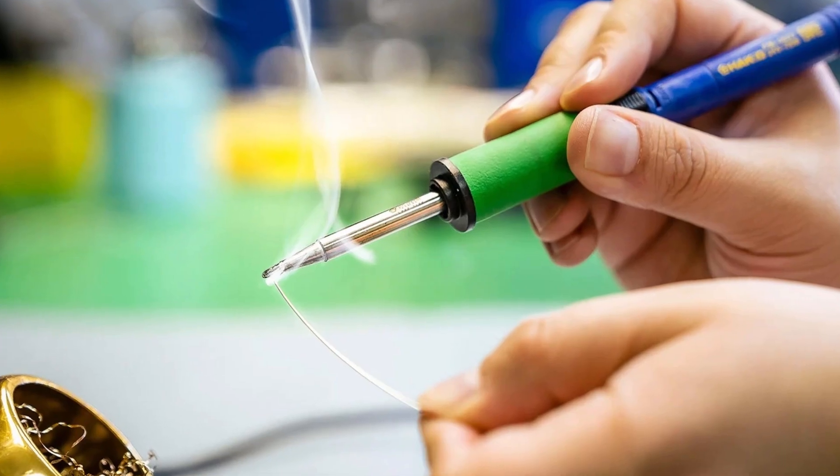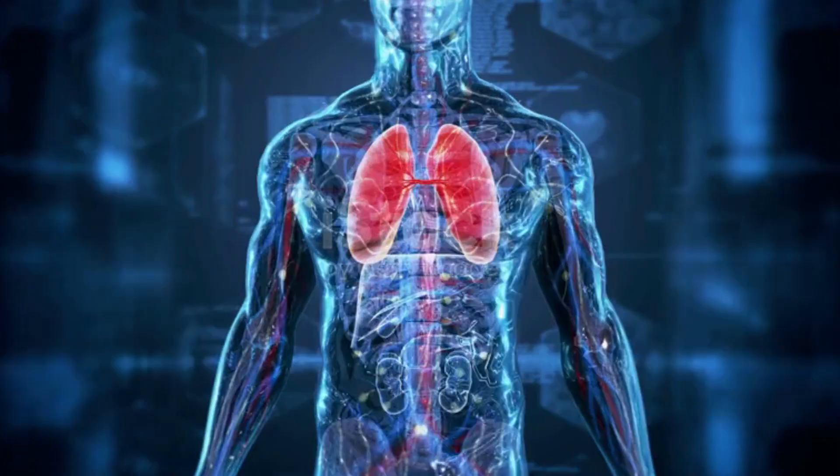The second highest exposure is through the skin. Only some forms of lead can penetrate the skin, and our kind of solder paste is hardly absorbed that way — so it is not our main concern. The most dangerous route of entry is inhalation: when we solder, the fume and smoke carry microscopic lead particles, and the body absorbs them 100 percent.